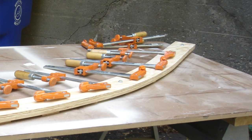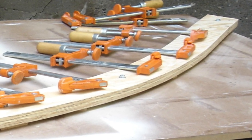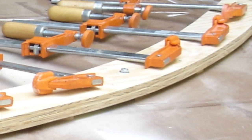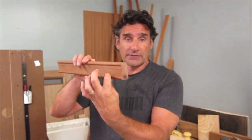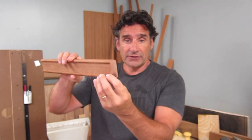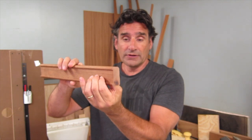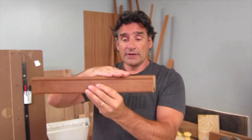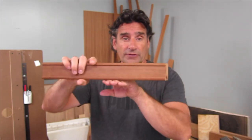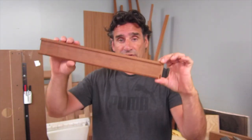And then to use it, I actually bolted it right to the flat work surface and put some spacers under it. And I put spacers under it so that this lip on the bottom of the piece of trim would go right under it and clamp it right onto the mold without being caught up anywhere. And that also allowed the bottom surface of the piece of trim to sit on a flat surface so I wasn't getting any weird twisting in this direction here.